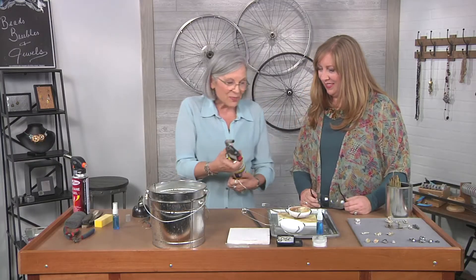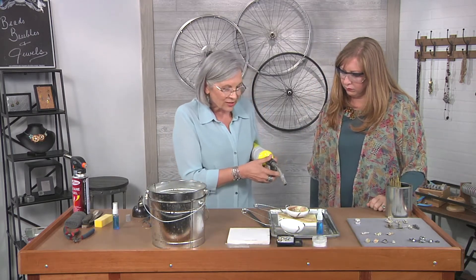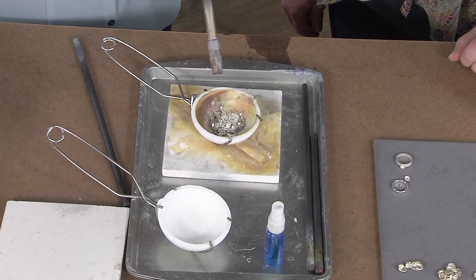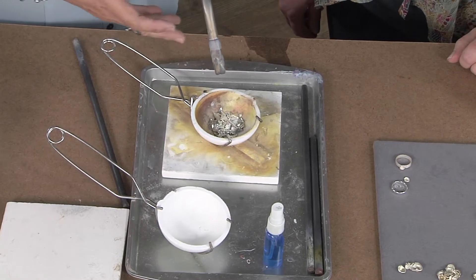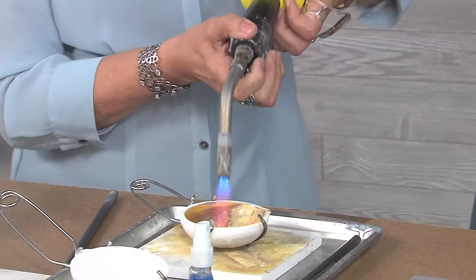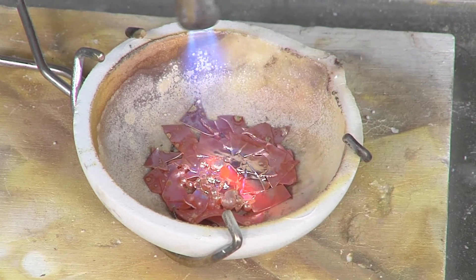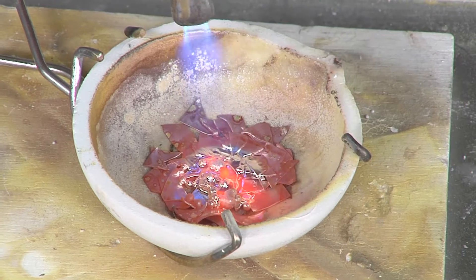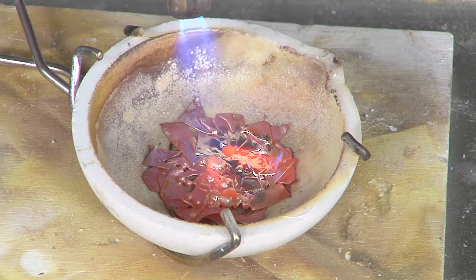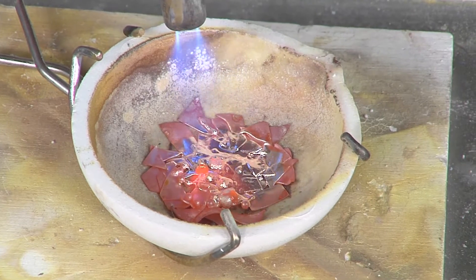I use map gas — it's a nice hot torch — and I usually don't hold on to the crucible until towards the end. I'll just turn on the torch; this will take a few minutes because the silver actually has to be a molten ball. If it's not totally molten, when you pour it it's just going to turn into a lump. You can see that orange beading — that's basically the flux and the borax, it's just liquid or molten glass.